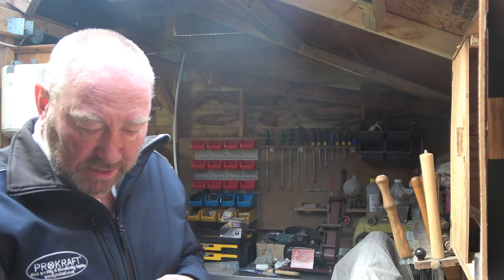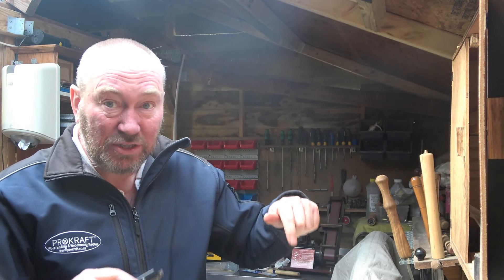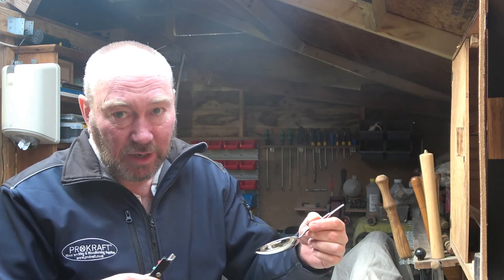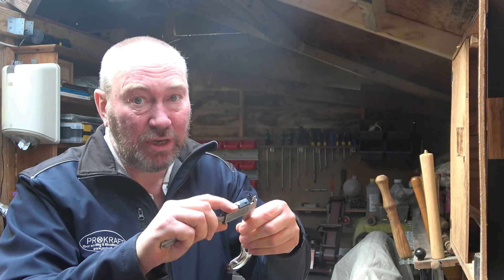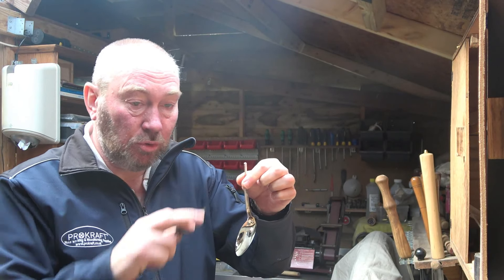The first thing I'm going to do, apart from having got some wood ready — which I'm not entirely sure what it is, I think it's sycamore — is to measure the parts. I'm doing this not to tell you what the measurements are, but to show you, because specifications do change. When I'm doing this video now this might be six millimetres, but in 18 months' time we might have a different model and it might be five and a half or six and a half millimetres. My message basically is: get your kit and your calipers or whatever measuring tool you've got, and measure it before you cut. It is 3.8 millimetres, so we're going to need a four millimetre hole to slot that into.